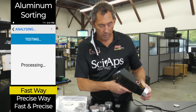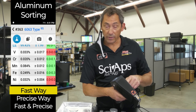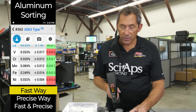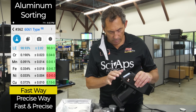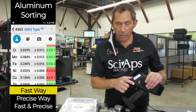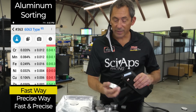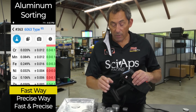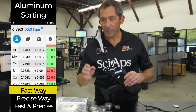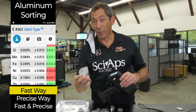Here's a 6063. A couple of seconds — 6063. You might notice it came up first as 1100 and then switched to 6063. This is something we'd recommend you use the longer test for. Old XRF guns, if they see a little bit of copper and nothing else in the first test, they're keyed to say 1100. But 6063 has a copper spec from 0 to 0.1. We see a common mix-up with old XRF guns between 1100 and 6063. Our recommendation: take the extra couple of seconds and measure that half-percent magnesium, which is what makes 6063 different from 1100.